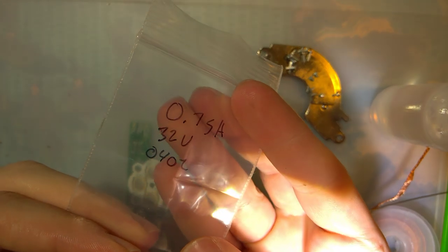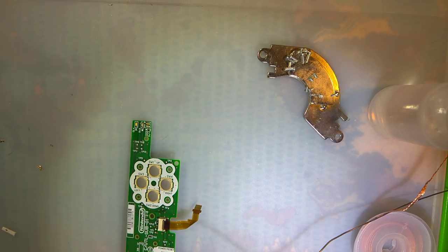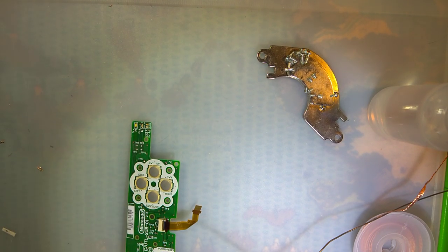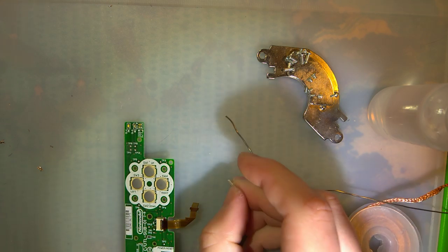What did I do with my new fuses? Oh, shoot — these are the wrong size too. These are stupidly small — these are 0402. I think I bought these for my Switch Joy-Con after I accidentally blew one of those fuses up, but I never got around to installing it. What I actually did was install some bodge wires and then a bigger fuse, and it still works fine — and it has a fuse.